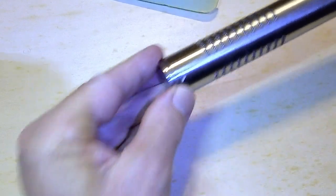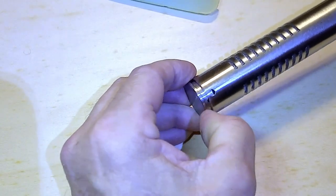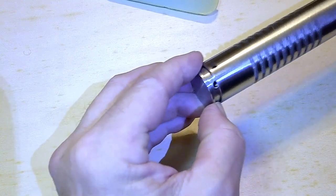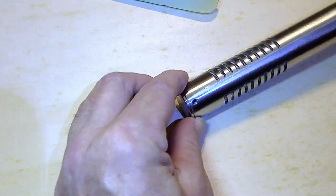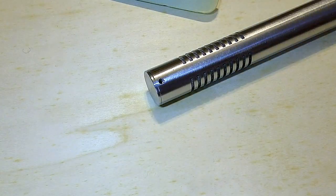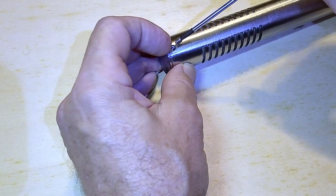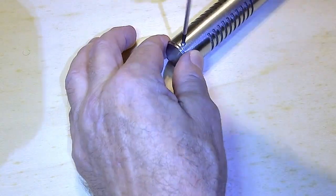Before inserting the motor inside, rotate it a few times in the same direction as you twist the wires. It will add some tension to the wires and it will form coils inside the body, making it much easier to force the motor inside. Keep rotating the motor if it feels a little stuck on the way. Around 4 to 5 turns should be enough. Close the cap and orient it properly to insert the screws. It should fit snugly in place. And now it's ready to record.